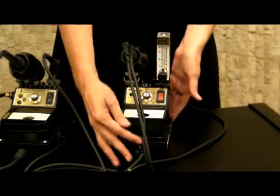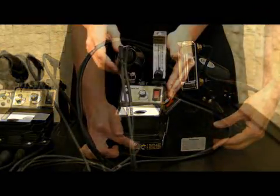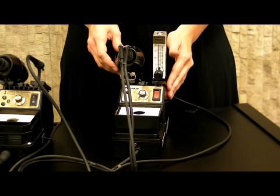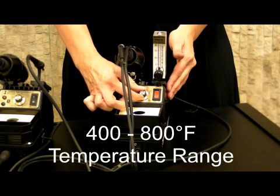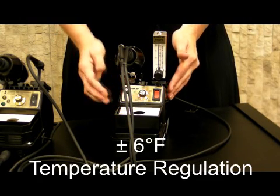The 971 HA is easy to maintain and has an external calibration feature. The 95W heater rating provides exceptional heat delivery and recovery, necessary for surface mount rework. The temperature range is 400 to 800 degrees Fahrenheit, and temperature regulation is plus or minus 6 degrees Fahrenheit.